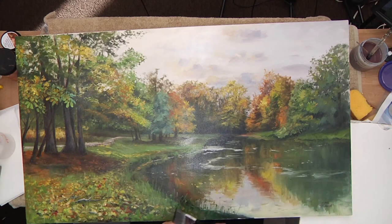Now, on the other one, the tray video, I showed some of the problems with it. We'll try to put these two videos together on the website, this big one here and the tray one, but other places, they might be out separately. There are lots of different ways. I'm going to be showing you how to varnish doors, large furniture pieces, and everything. This varnish is really made for large furniture pieces because it's a little thicker. By having it thick like that, it doesn't drip down and sag.